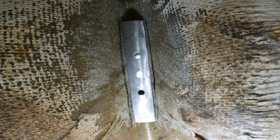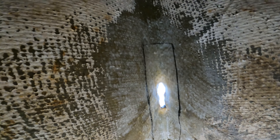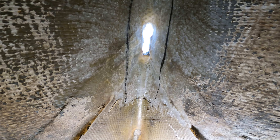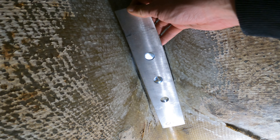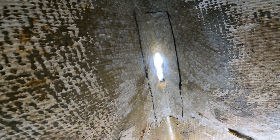I've planed it up pretty good and I've remarked where I want to flatten out the fiberglass. Basically I'm going to be building up the fiberglass here in this rectangle until it's flat — it's going to be a lot of glass. That's how I'm going to mount this chain plate. This is the backing plate to the new bobstay chain plate. It's all nicely cleaned up and sanded, so I'm pretty much ready to go.